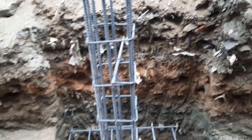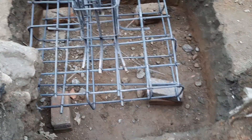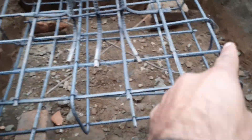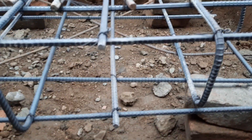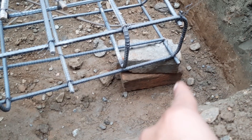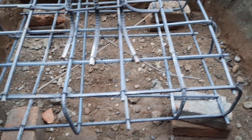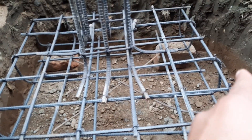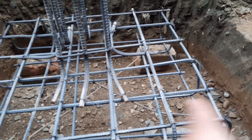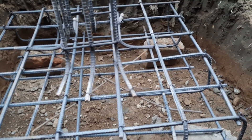Now let me guide you for the steel reinforcement details. This steel box size is four feet by four feet and the depth of the bed is nine inches. The bottom concrete cover is about eight or nine inches, which is wrong. The concrete cover should be about three inches at the bottom, and for all sides you can use three inches or 75mm concrete cover. They are using about nine inches, so they are just wasting their time and concrete.